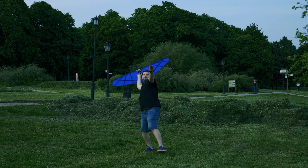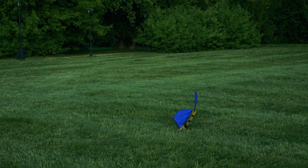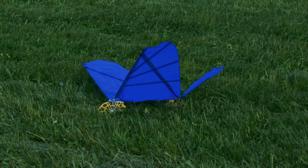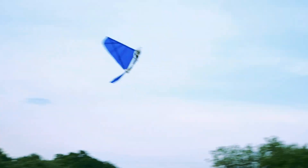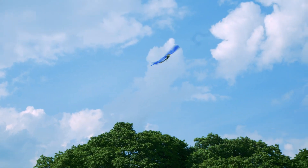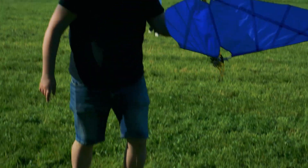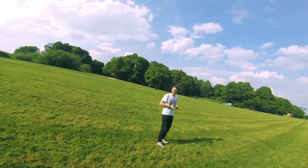We are back in the park. After analyzing the previous failures, we saw that after gaining that weight, the ornithopter started to depend heavily on the tail's positioning. The smallest drift led to a drastic shift in the bird's behavior. That is a very important part, because if the tail was turned even a bit, the bird would instantly stall on launch. We were ready to abandon the whole dream of ever flying. But taking into account all the mistakes, we decided to have another shot. And oh boy, would it fly.